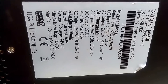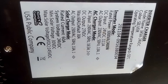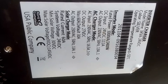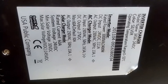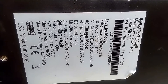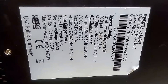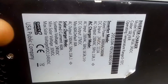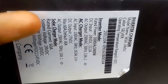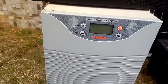The system voltage is a 24-volt system. The minimum solar input voltage is 30 volts DC and the maximum solar voltage is 145 volts DC. As time goes on, I will show you how to interpret what is written on the nameplate and use it to design your system.